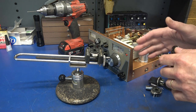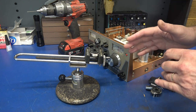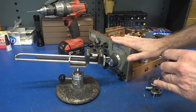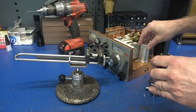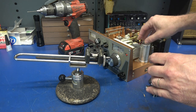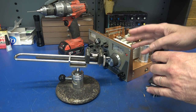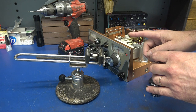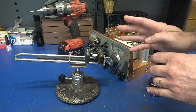As I stated, these multi-section capacitors can be configured to whatever your application is — it does not have to be for this receiver. It has to do with the values of the multi-section cap that you're trying to replace. In this case, the R4B has three 300 microfarad at 200 volt sections and one 20 microfarad at 200 volts, so we need to build a four-section cap.